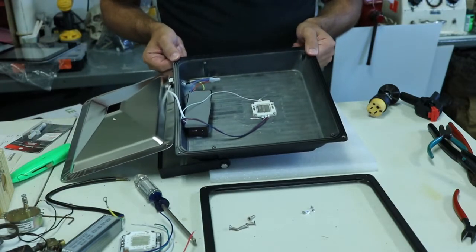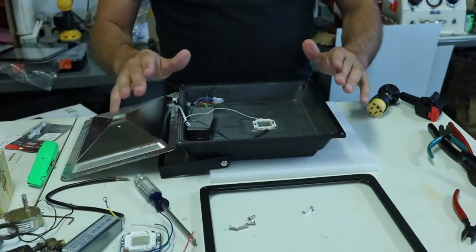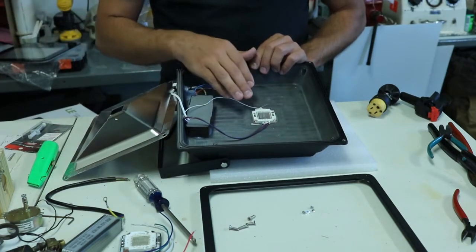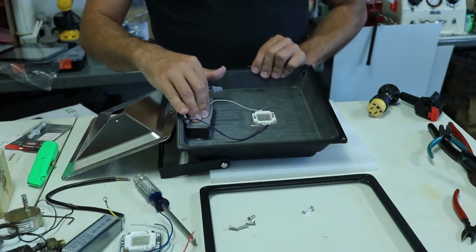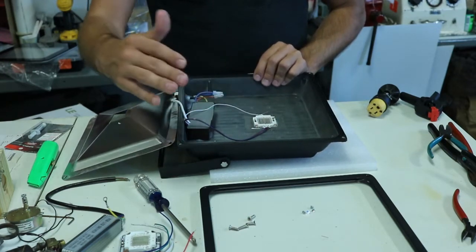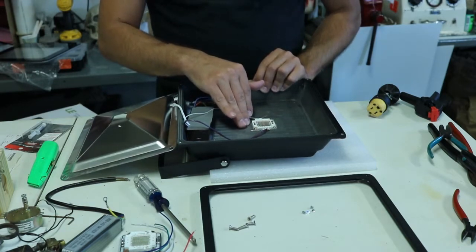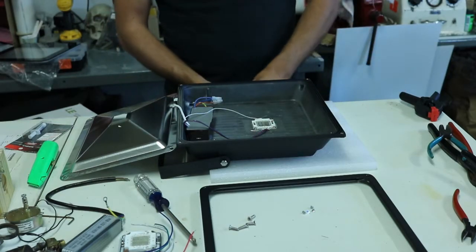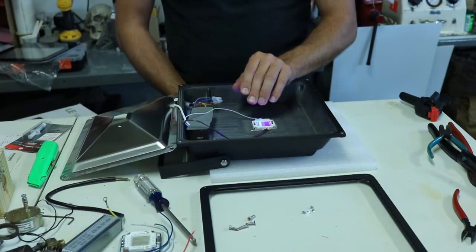And this is what it leaves us — basically there are only two components in here: the actual LED module and the LED driver. Now I'm not an electrician, I'm not an expert on this, this is what my research led to. Basically as the LED warms up it actually requires less voltage to keep working. The purpose of the driver is similar to a fluorescent ballast — it controls the amount of voltage going to the LED and pulls that back as the LED warms up so it doesn't burn out. So what this is actually doing is thermal throttling, just like if you're into PCs — it gets hot enough to where it shuts off to prevent further damage and then it will restart.